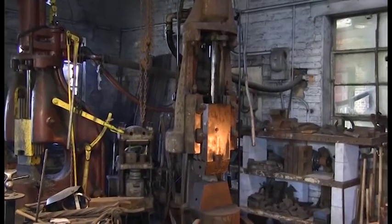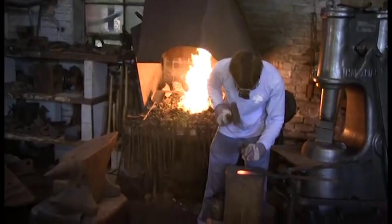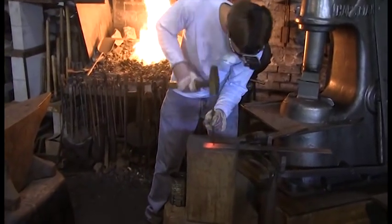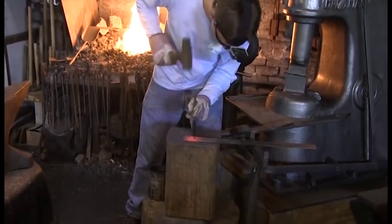Carter managed to finish the taper part of the wedge, and then he went on to hot punch a small hole. The support stand was set up and everything was ready, but the punch we had just made was lightweight and inadequate. It got hot easily and bent. This operation with this punch was way over Carter's head.